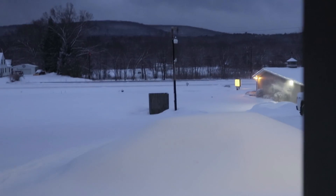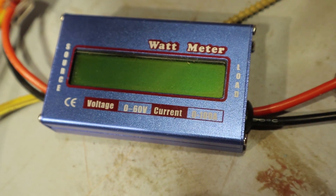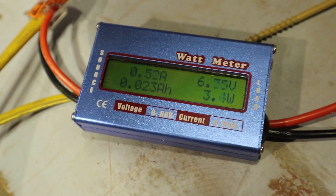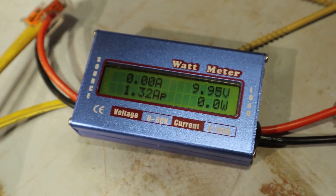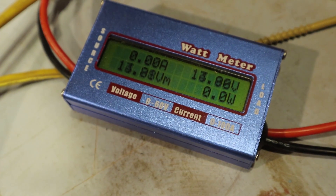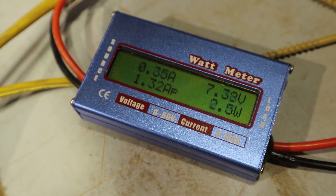Normally if you have fewer blades — and I only have three — then it will be a faster spinning turbine meant for heavier winds. It's really going right now. I'm just using this for volts, it's not connected to a load. You can see it dies off when it's below six volts. Apparently we're in a lull of wind right now. I saw up to like 15 volts for a moment there. When it's really blown out there, this would be suitable for trickle charging a lead acid battery.